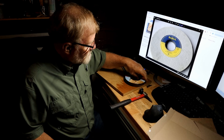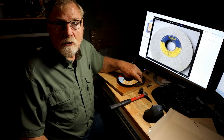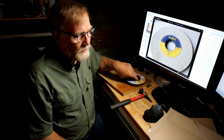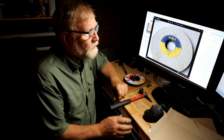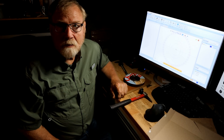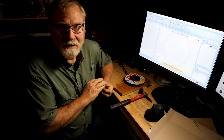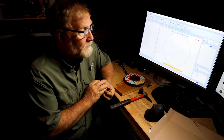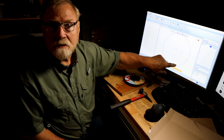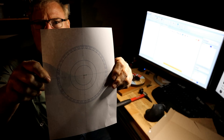My main purpose right now is to keep those holes from getting blocked and to prevent the outer flange from touching the abrasive on the wheel — and I've got that covered. Then I thought: I need to make another one, and I wondered how I could make those holes. So I got on my CAD program — I use BobCAD, been using it for years, not that expensive. I drew out a template, put the holes on it, and I can print that out at a one-to-one scale, which I did.